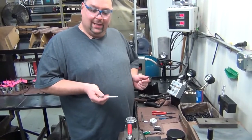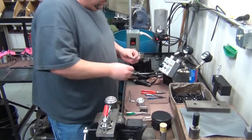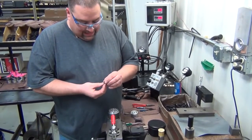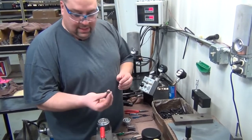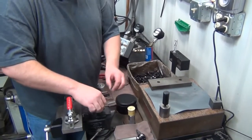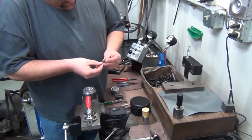Now, we're going to remove the idler gears using a magnet. We'll pull these gears out. Again, we will visually inspect for any wear, debris, chips. If we're not seeing any, take them on the 600 paper also and smooth out each side. Then visually inspect again.